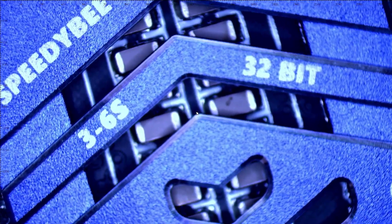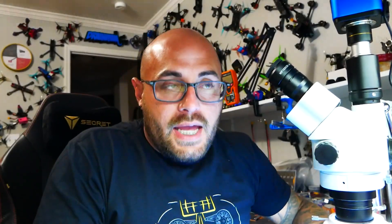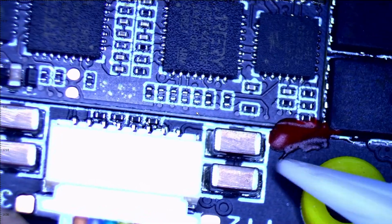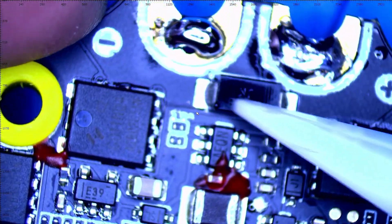Quick dive into the scope. You can see the beautiful ESC heat sink laying right on top of all the MOSFETs. As those MOSFETs heat up, heat goes into the heat sink which is fanned by airflow from your flight — heat dissipation keeping everything cooler. MOSFETs that get hot equal explosion, so you want to keep your ESC cool. Underneath you can see all the capacitors, providing onboard filtration alongside the external 1500 microfarad. You can also see a separate board plastered on here, and that monstrous TVS diode we talked about.